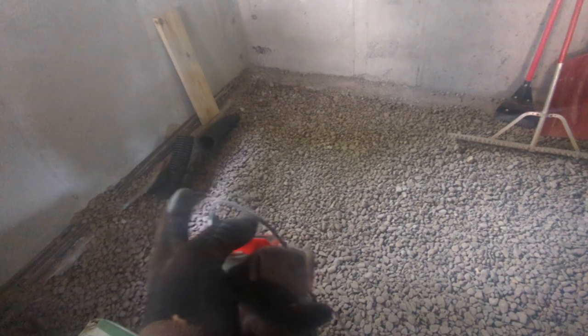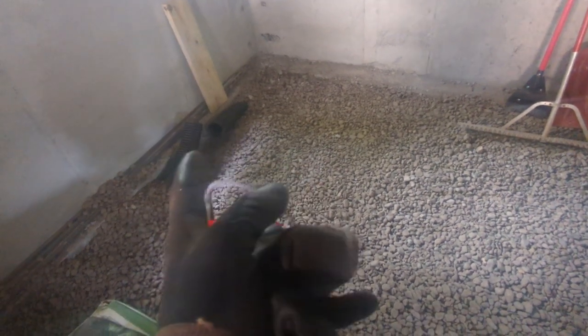But that would mean that I could take off of that big diameter with like 2 inch and run over here and up to get the washer and the slop sink over here, which I think is going to be in this corner. We could always push down to 1.5 inches for the slop sink, but the washer's got to be 2 inch. I'd like it in the wall with a typical washing machine box assembly.